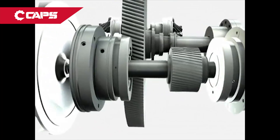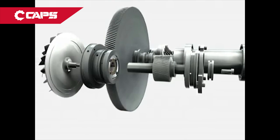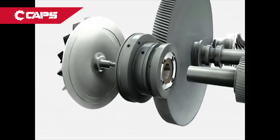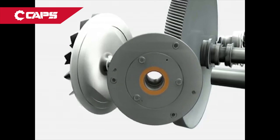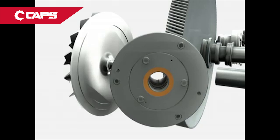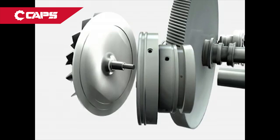The assembly rides on a thin film of oil separated from the air by non-wearing carbon ring seals, ensuring 100% oil-free ISO Class Zero air in all operating conditions, including being unloaded. Single-piece carbon ring seals minimize air loss by more than 50% when compared to labyrinth-style seals, which could save users more than 140,000 kilowatt-hours of electricity per year.